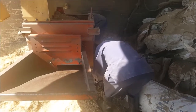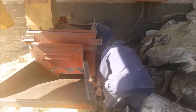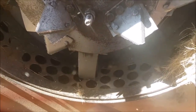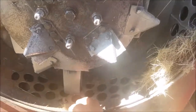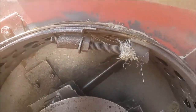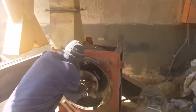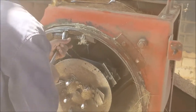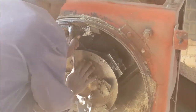This is our demo machine at the farm. I'm opening the door now. At the moment they're using a 50 mm screen, which we are going to remove right now. As previously discussed, these are the serrated blades that do the pre-cutting, and those are the hammers. We're going to change the screen now by loosening these two bolts. One of the operators is changing the screen — all it needs is a 30 spanner.